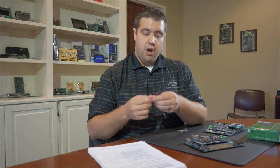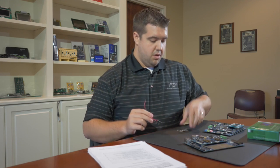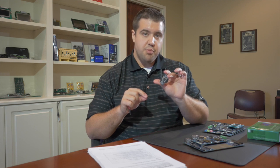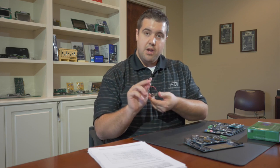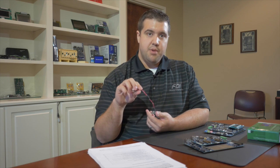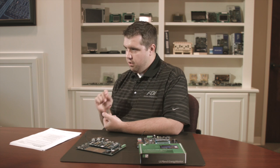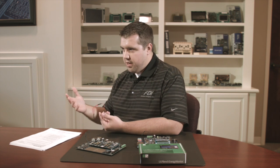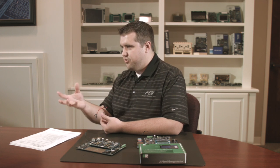This is the cable fabricated using the Renesas app note. It's a four-header cable, three to one. It connects to the ULP energy monitor bench device on the 3.3 volt line. The rest of the headers can connect to all three jumpers on every Renesas DK kit. That allows us to measure all three power domains at once. If you're trying to measure just one power domain you can hook up one header — it really gives you a way to focus in on a specific line without having to modify the board too much.